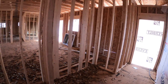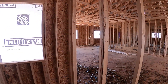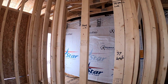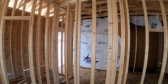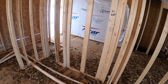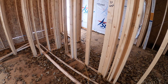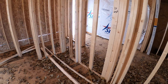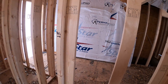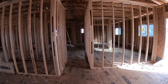Once we're all finished here we'll move all the plumbing and get the concrete floor filled in. We've got laundry back here. One thing we did — nowadays refrigerators are getting so large that they stick out so far into the room. What we've done is turned the studs flat to give us about an inch and a half to two inches of added depth for the refrigerator, so once we get the cabinets in on each side we can recess that refrigerator all the way back.